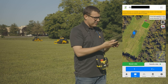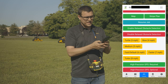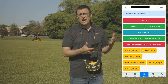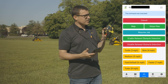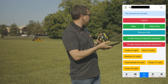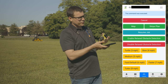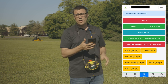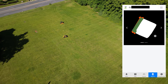Within the app there are a couple of options. I can change the speed of the machine — for example, set it to three miles an hour or turtle speed, which slows it down for better cut quality. You dial in the speed based on the type of property you're mowing. On the remote control, the trigger on my left hand side toggles speed up or down. We could go down to about one and a half to two miles an hour and it'll just creep along slowly.